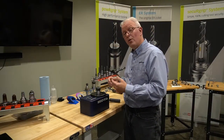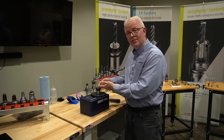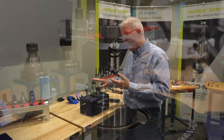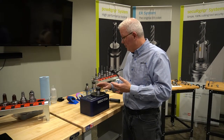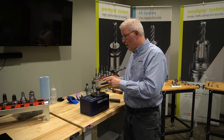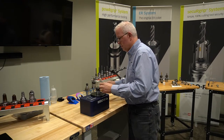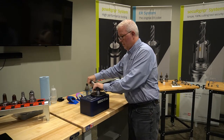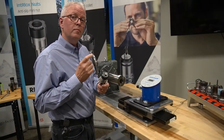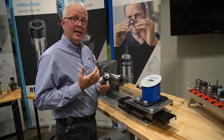For this next round, we've adjusted that backup screw up quite a bit. As you can see, our torque pin is now resting on top of that backup screw — it's not seated all the way down. Now let's put that same 100 foot-pounds of torque on that nut and see what result we have. Let's go ahead and put our tool holder in where our torque pin is up against our backup screw and see what kind of torque loss this creates.